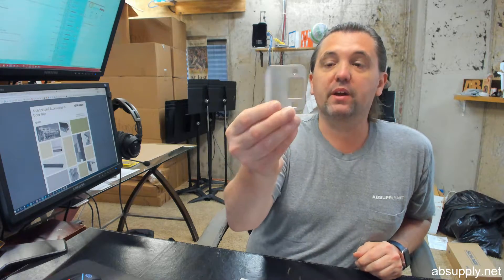Imagine if you stand on the pull side of the door and run your hand over the face of the door and the frame — the door has moved in ever so slightly, like about three thirty-seconds of an inch. Imagine if that dimension was, for some reason, a quarter inch or three-eighths of an inch. You would certainly need a strike basically exactly like this. You could have that condition easily if you added jamb extensions onto an opening.